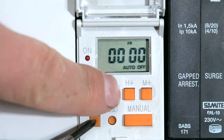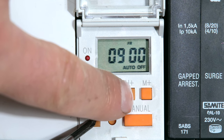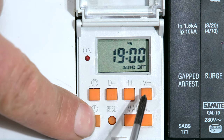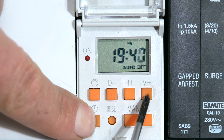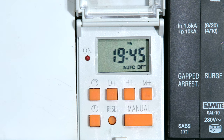I keep the clock button depressed and go to the H plus, which is the hours. I'm going to set this to the current time at the moment, which is 7:45. To set the minutes, I follow the same procedure — I press and hold the clock button down and then hold the minute plus button. Notice it is incrementing automatically. The current time is 7:45, so I'm now going to press this manually to get finer control, and there is the current time and date.